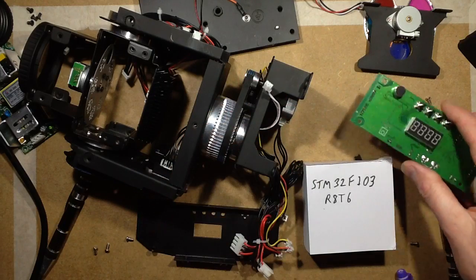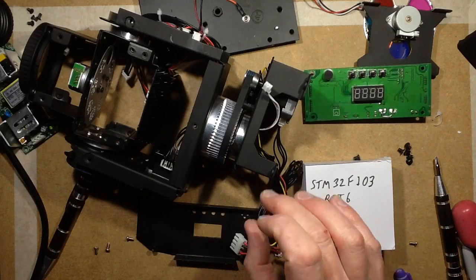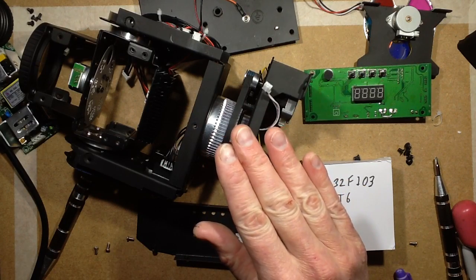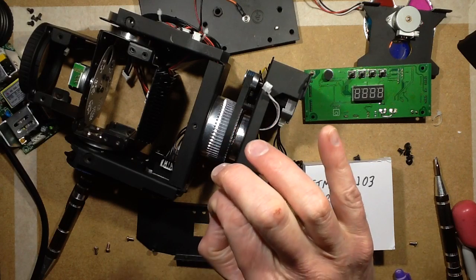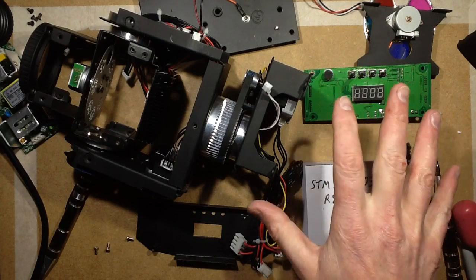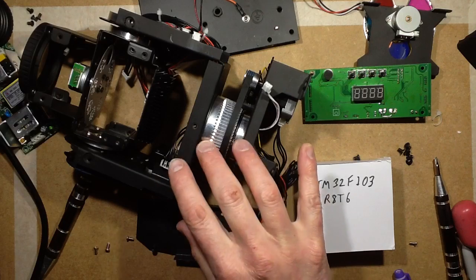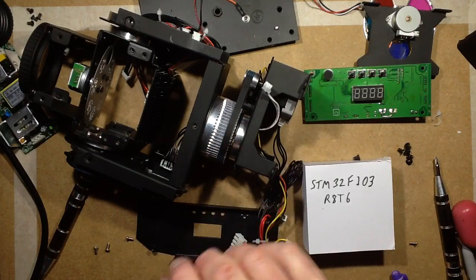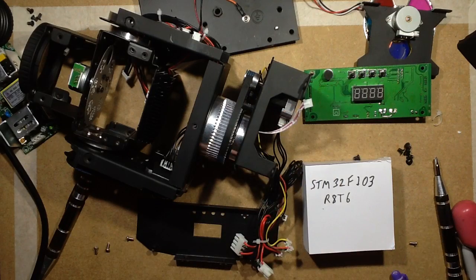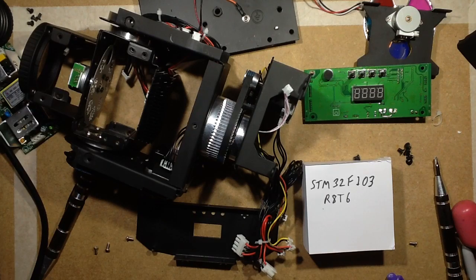I will say there was one quirk when I was playing about with it. If you set the position and you had a fairly long throw and then you adjusted the colour or gobo, the actual pan and tilt just nudged a fraction, as if it was just going in 1 microstep. I don't know if that's just because the processor was forgetting about the driver momentarily because it was concentrating on other things being driven, or whether it's a little bug, you know, some common file nudging that. But it's no great deal for the application it's designed for. It's not a significant factor. So yeah, you know what? It's definitely a nice little light.